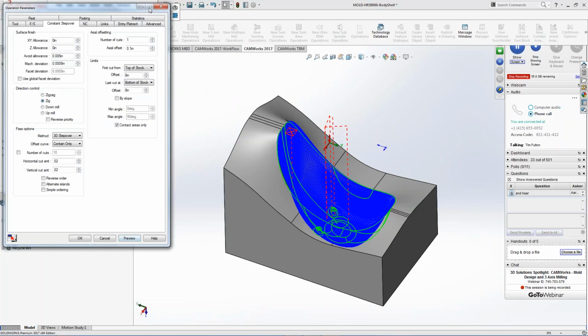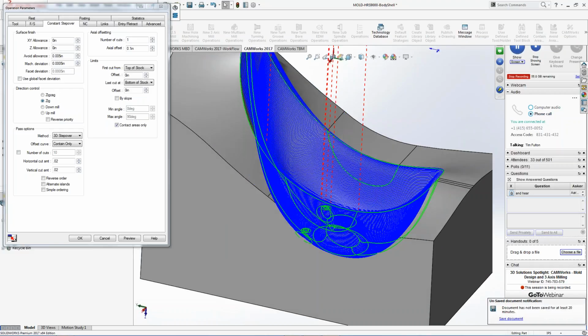So that's a basic idea of getting the part from engineering through simulation, through the 3D printer, and now all of a sudden you're using that same model to put the toolpath on. You're not redesigning and trying to guess what the fillet was supposed to be, or fudging the numbers on the shop floor and going, well, engineering said it at 1/8 of an inch, but those guys don't know anything outside there. I cannot get an 1/8 inch tool that deep in the model, right?